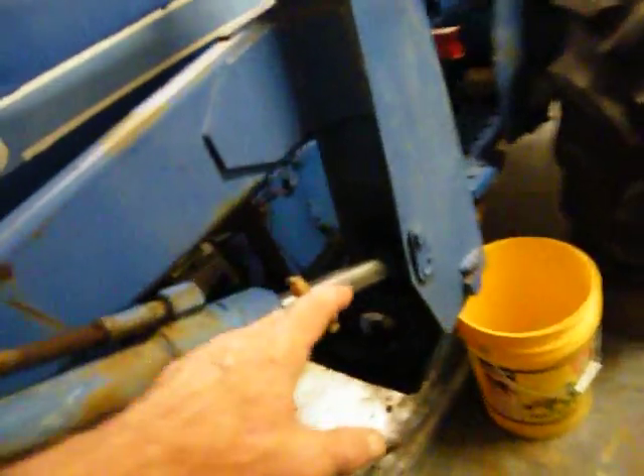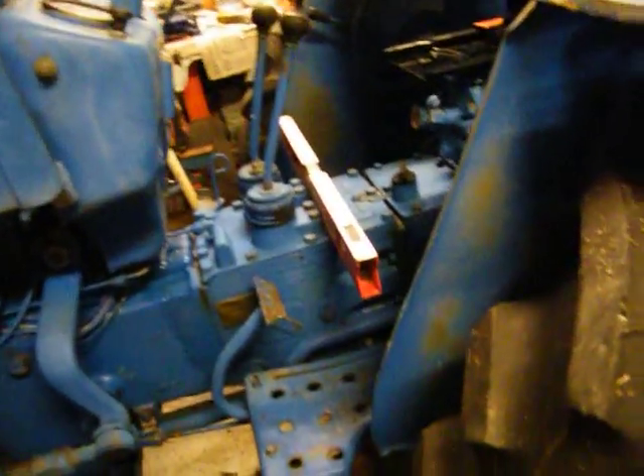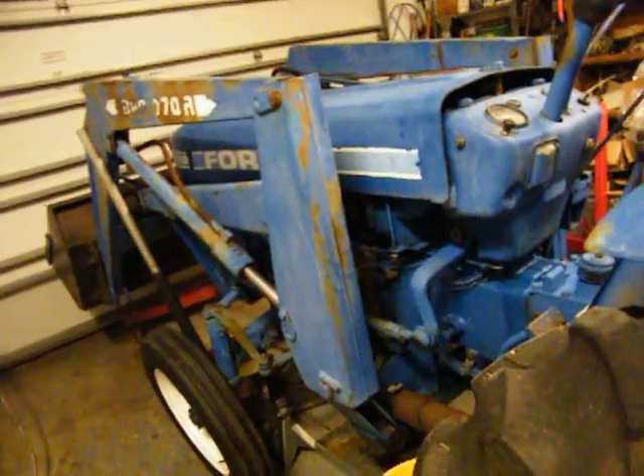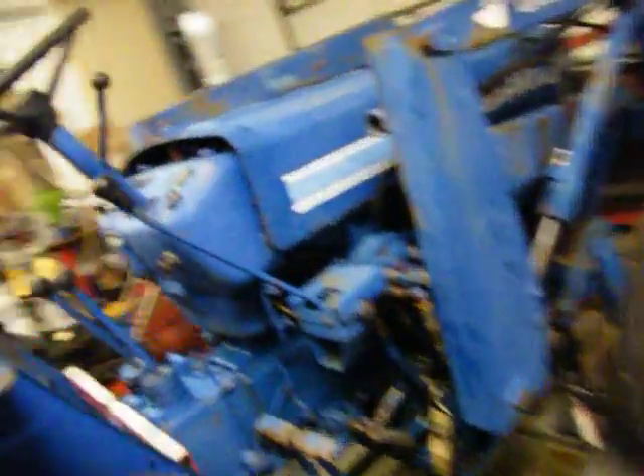The main thing is change the lines, get the cylinders shoved back up and drained, and get all the water out — because after an hour I can't steer it anymore and it won't lift the bucket up and down anymore. It's full of water. That oil turned from honey to milk instantly, because I didn't drain it completely — didn't drain the pump, didn't drain the cylinders. When it's just oil it doesn't seem to leak out the seals, but with water in it, it leaks like crazy and shoots a stream right out of that big round thing forward.